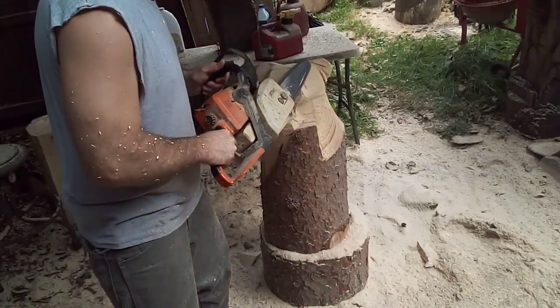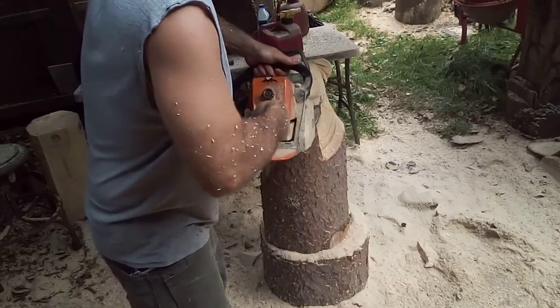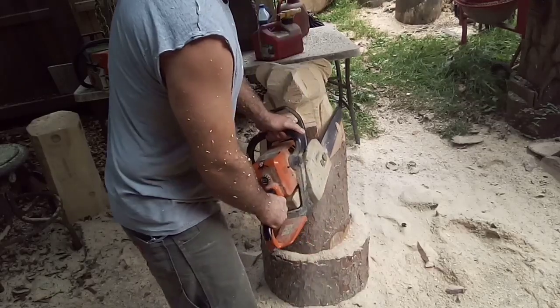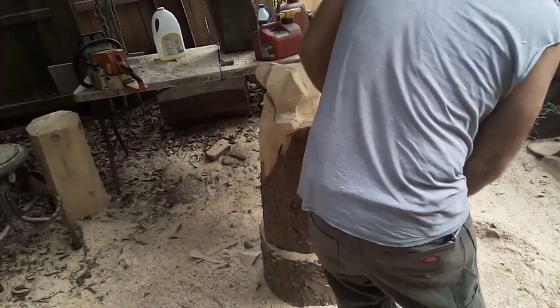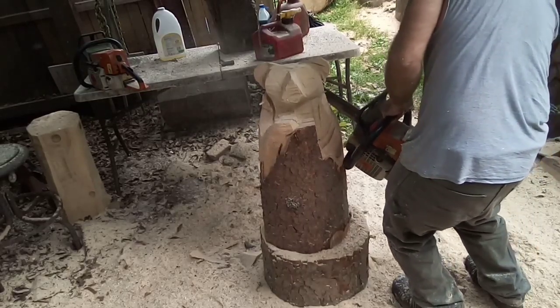But when I clean them, I usually go a lot deeper in. I start with a bigger diameter log and then cut out a lot of the outside, like the sapwood, because that's weaker wood. And pine, but here I'm using spruce. So with spruce you can get away with a little bit more of using the outside of the log because it's more consistent than pine usually.